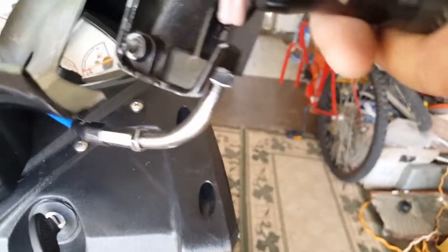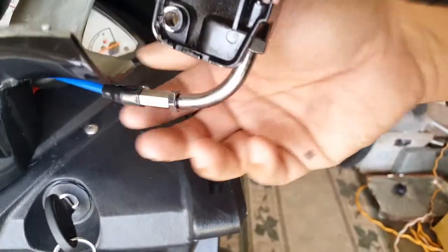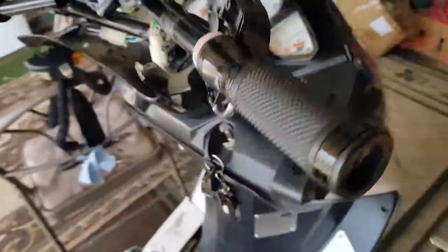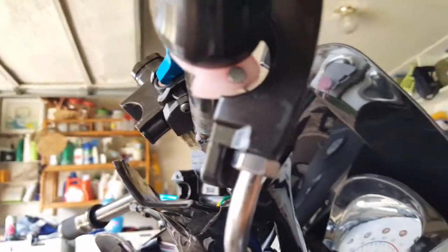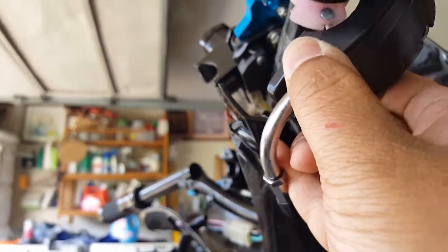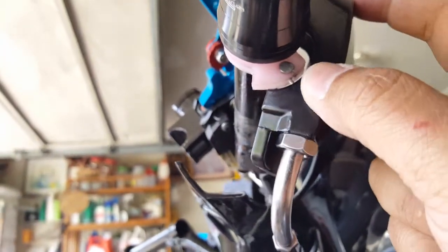We'll get some enamel. So what we're going to do is take him out now, because we need to take the throttle cable completely out. In order to take the pod out, we need to unlatch him here from this socket. So it's quite a bit of reversal, but we can still do it. Let's go ahead and grab either a flat side or something to give a little bit more strength to push him through. So what you want to do is, see there where the cable is? He's coming from the other side, so you can't just pull him out, right? Because he's held in.